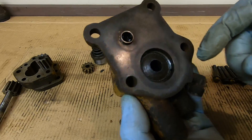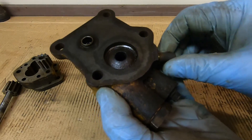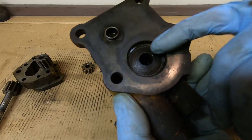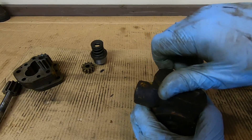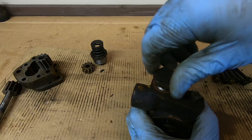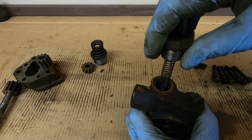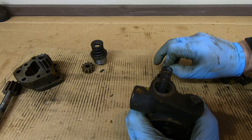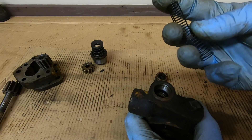When this packing seal wears out and starts to leak, that diesel fuel is going to find that little hole right there. That hole connects to this angle fitting and a tube that runs down the side of the engine — when that starts dripping, you know your seals are starting to give out in the pump. The only other thing is the pressure relief down the bottom, which I loosened off camera. There's a little bit of spring tension, and a copper washer for the plug.